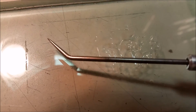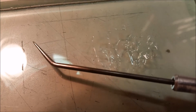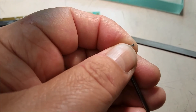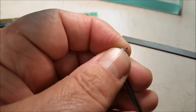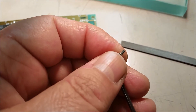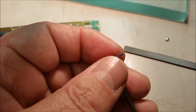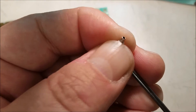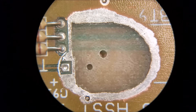I'm going to show you how to apply it. We'll take this tool, mix a little bit, and barely wipe it on the board. I need to file the end of this off a little — I forgot to take some off. Just use the flat file, holding it steady with your fingertips at a right angle. Okay, I got it all flattened out. Now I'm going to go ahead and put some epoxy on the patch area.